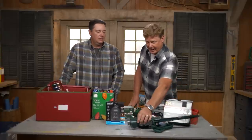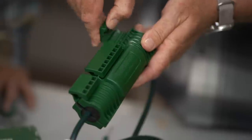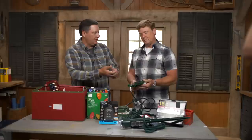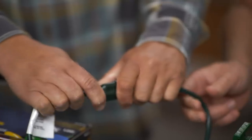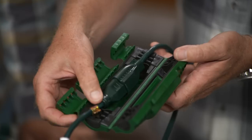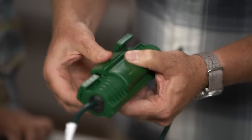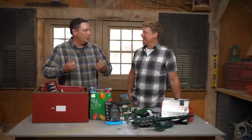Inevitably you're going to be connecting cords, so here's a clever solution. We're going to be plugging into a GFCI receptacle outside, and when cords are plugged together laying on the ground — if it's raining or snowing — there's potential to trip because the GFCI is doing its job. Any water that gets into a little gap can make contact with the terminals and trip that circuit. This connector seals it up and tucks it in with rubber gaskets on the ends — does a better job than the eight or nine loops of electrical tape my neighbor uses. And it keeps it from pulling apart, so if you have multiple sets you don't worry about something coming unplugged.